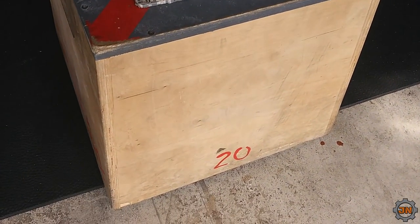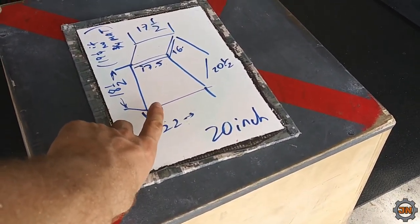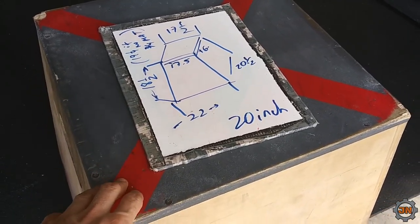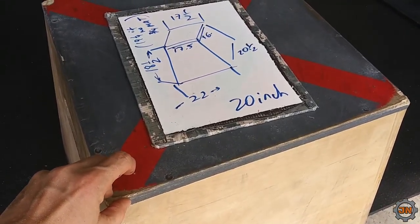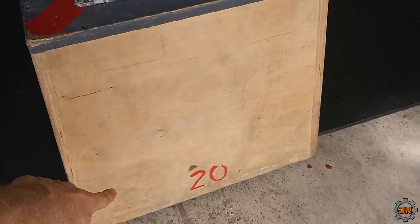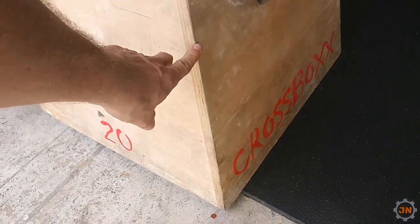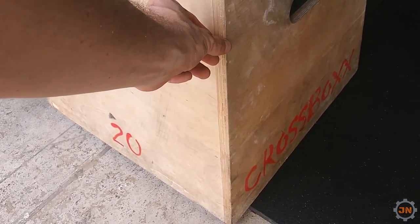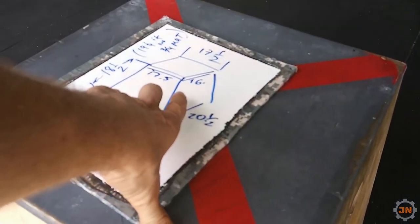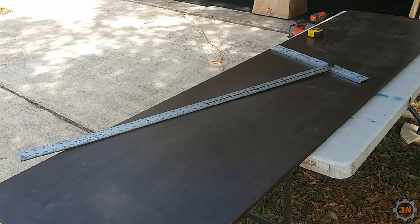For a 20-inch box, I did the dimensions already: base is 22 inches, top is 17 and a half, height is 18 and a half — because I'm gonna put a rubber mat here which creates thickness — or 19 and a quarter for the side on this box. For the other side, because they line up, we lose an inch and a half since it's three-quarter-inch plywood, so you get 20 and a half and 16.